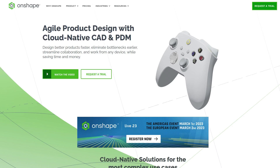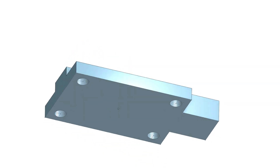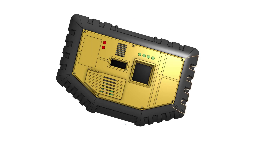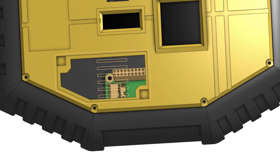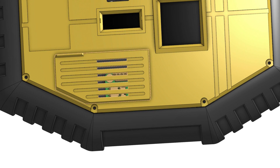And with that, it was time to move on to the case. I wanted something industrial, something with substance, that felt like a piece of equipment that had been used — something between Ghostbusters and Alien. I'd done some 3D modeling before, but this is easily the most complicated project I've done from scratch. I designed the 3D case in Onshape — again, not a sponsor, but their free license is awesome and you should definitely check it out. My basic process was measuring and mocking up all the components so that the cutouts and screw holes would line up correctly. I then mocked up a case and used the components to shape the supports and cutouts of the screens. I added a little door, which will be attached with magnets so that you can have easy access to the SD card of the Raspberry Pi without unscrewing the faceplate. I exported this to the 3D printer and then waited for 30 hours.